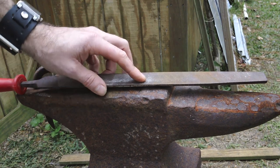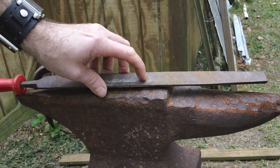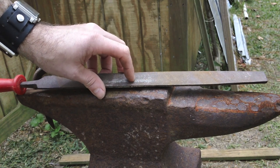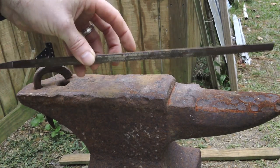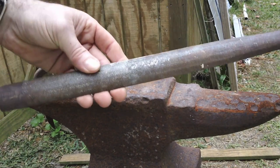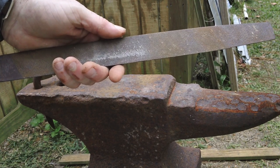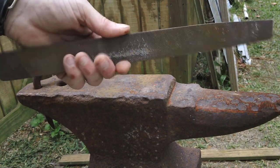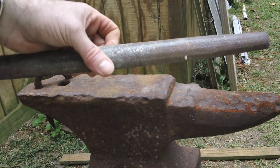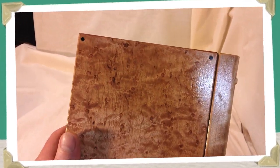What it does is enough acid that it'll get a little etch, a little bit more of an edge on the top of your file. Pull it out, wire brush it off, oil it a slight little bit. Now it's going to be darker, it's going to turn a little bit black, but you don't change any of the quality or the hardness of the steel, and it'll have a little bit more bite to it again. That's it.